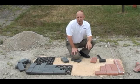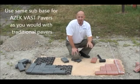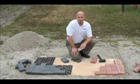A couple things to keep in mind when installing AZEK VAST pavers. First, your subbase is going to be a traditional subbase with a stone aggregate, sand on top of it, compressed down tight. After that, AZEK VAST pavers become a lot easier to install than traditional concrete pavers.